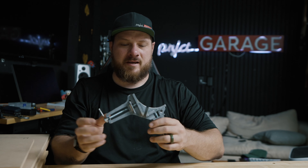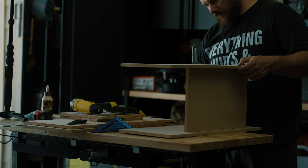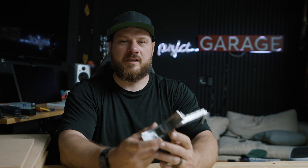And then the other — I would say mostly must-have, because it's gonna save you time and energy trying to keep things together — is one of these guys. It's a 90-degree angle clamp, so it keeps your boards at a 90-degree angle while you glue and nail them or screw your pieces together. I have two of these so that I can double the work on two different sides, and it makes it a lot easier to get through the build.